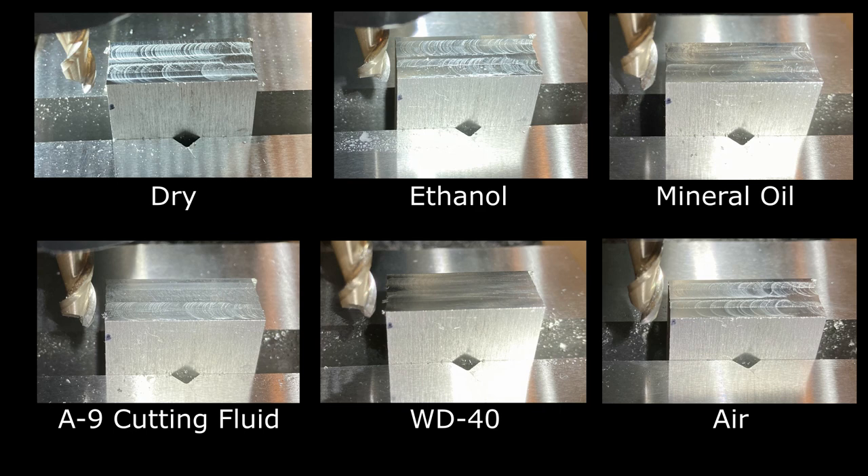The other thing that's missing here that I didn't test — in retrospect I should have — was water. Water obviously is not great for machine tools because it creates rust, but there are concentrates that can be added to water to provide rust prevention and lubrication. That's what is used on a real milling machine with flood coolant. I actually have some that I've used before and have not gotten super great finishes with it, probably because I'm just putting a little bit on the workpiece rather than running flood coolant under high pressure. For a typical hobbyist, WD-40 is going to be your best combination of low cost, great results, and easy to find. If anyone has suggestions of other lubricants I should try, let me know.